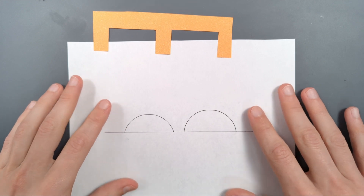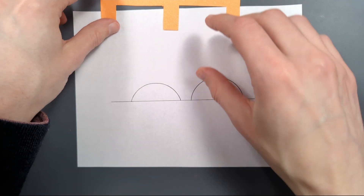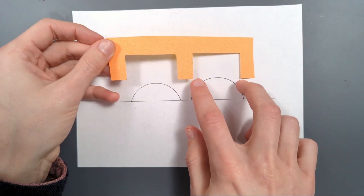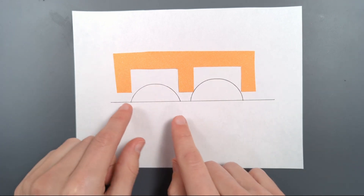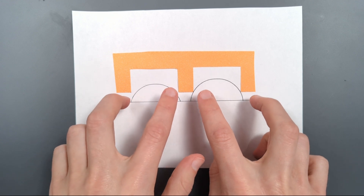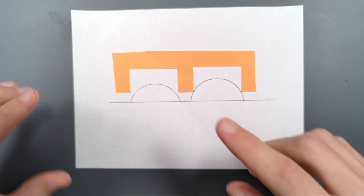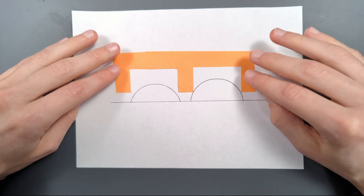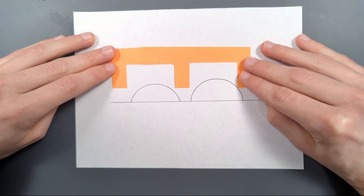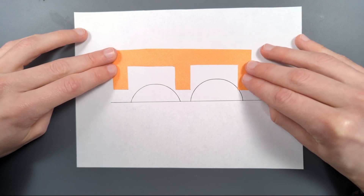To explain what I mean, I drew a little diagram. Here is our setup: the same circle size for the detent ball, one slightly pressed in from the other. I've tried my best to make the two holes the same size, as I found on this Kvist variant, and to have them centered above the balls. Because they are the same size and centered, it makes contact with the first one but hovers above the second one ever so slightly. As the blade travels, that detent ball ends up just hovering over the other ball and never actually makes contact.